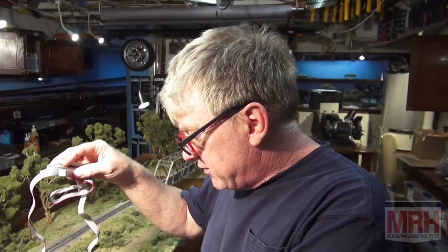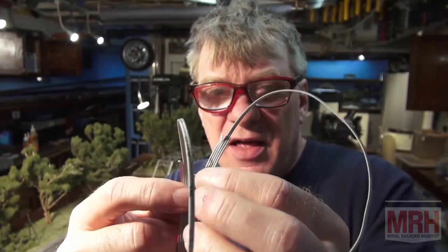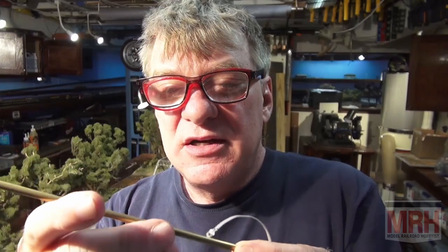Now turning attention to the top of the diorama, I need to put in the LED sensors that sense the distance and give us our calculations. The sensor harness comes on a flat ribbon wire — only four of the wires in the harness are necessary for the two sensors. I've stripped away the extra wire so I've got two small wires connected to each sensor, which I'll run through a 3/16 brass tube. I'll run the brass tube through the foam of the layout and then run the sensors up through it, flush with the top of the railroad ties. I noticed the solder joints on the sensors are open to the air, so I'm wrapping them in black tape to prevent a short as they go through the brass tube.